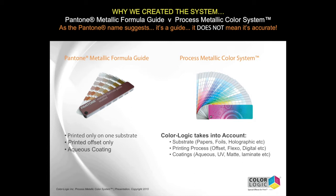You should also take into account the coatings or laminations that you put on top of the print. One thing you should be aware of is that foil substrates will scratch very easily, so you need to protect them after they have been printed, either with a coating or a lamination. And if you choose lamination, there are two main options. You have matte lamination and gloss lamination as the two extremes, and you're going to get two different results. If you use a gloss, it's very high shine. I personally prefer the matte lamination. It gives it a really soft touch, luxurious feel. But we do recommend that you try different coatings and laminates over the top of your print to see the end result.